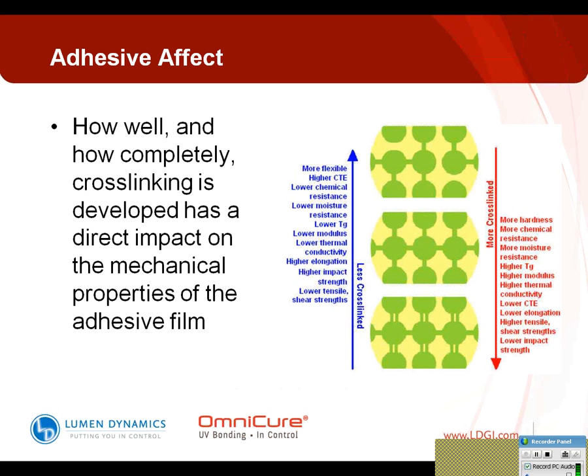So if the process is not repeatable, although the material bulk properties may be cured, there could be changes within each of these different areas, which could have long-term effects on your device or when the device may be in use. So it's extremely important that process repeatability is built in to ensure that you have a consistent process.